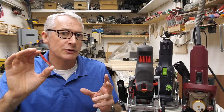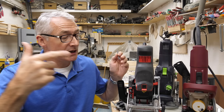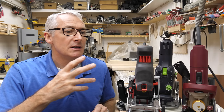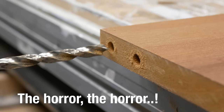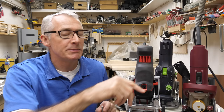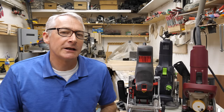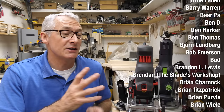The problem I have with them is quite simple. I'm working with 18mm boards almost all the time, and because these IXConnect fittings are 60mm long, you need a 15mm hole in the face of the board and a 45mm hole in the end — and this machine will only do a 40mm plunge. That's not great when I'm spending almost a thousand pounds specifically to handle knockdown fixings; having to manually drill out every hole with a separate drill doesn't seem like the best use of my time or money. So I opted to put a bit of extra money in and accept the higher ongoing costs of the Lamello — then it's just a case of a quick plunge, a quarter turn with an Allen key, and it's done and locked up tight. It's a shame, because the Mafell is a really great machine, and if you don't have those restrictions it's a fantastic tool that sits nicely between the other two in terms of price, capacity, and consumables.